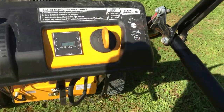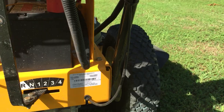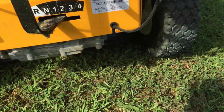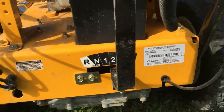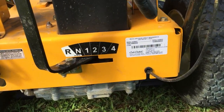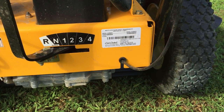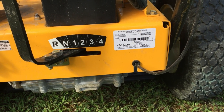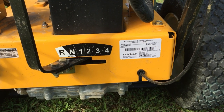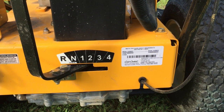Like I was showing you, you've got your gears back here where you can put it in reverse or put it in neutral. They recommend that you put it in neutral for starting it. If you get into a tight situation and you can't manhandle the mower and pull it back out, you just put it in reverse and back it out. When I load it on the trailer, I leave it in reverse — that basically locks the wheels so it won't be moving around on the trailer.